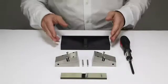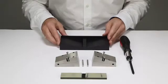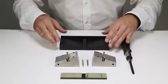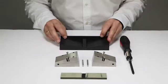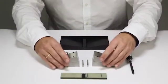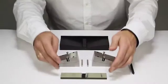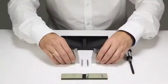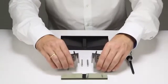Today we present the assembly jig for the i3 compression specimen. The jig consists of the base jig fixture, the wedge set, alignment pins, and the compression specimen. In the first step, you need to separate the lower and the upper wedge.